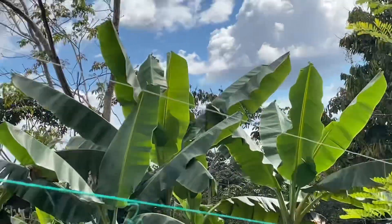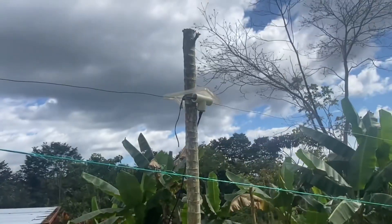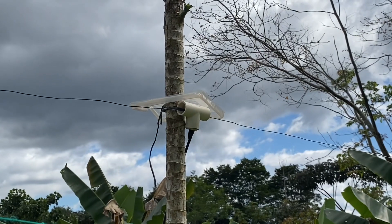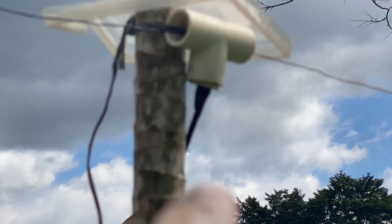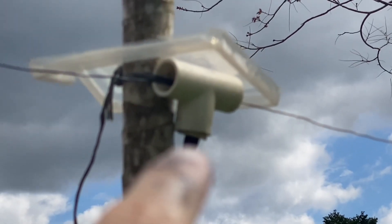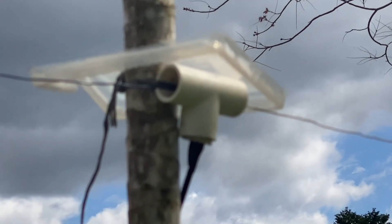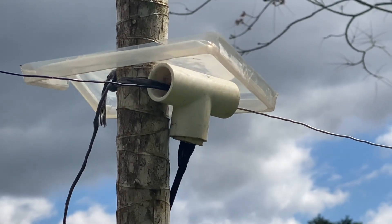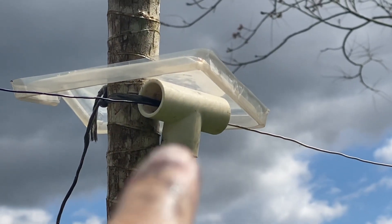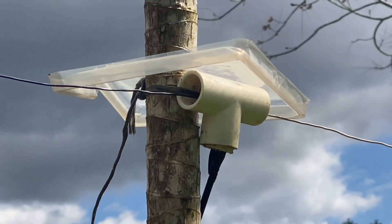I have a feeling it's going to be a little bit off — I'm going to have kind of a bad SWR, but we'll make adjustments as necessary. Keep in mind that where that connection is entering that PVC connector, where that black wire is entering there, there should be a balun there, and there's not.